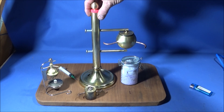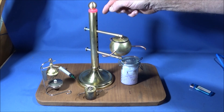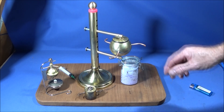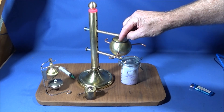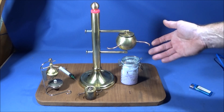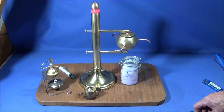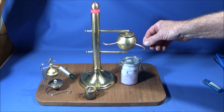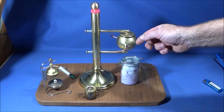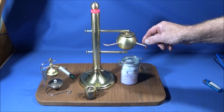On the Myford ML7 I locked the spindle up with the indexing system and then did equally spaced holes all the way down the tube, an inch apart, so that I can make adjustments for any future engines. I found this lightweight ball — I think it's off the top of some furniture, probably a brass bedstead or something. The only part I actually bought was this copper tubing and obviously the silver solder.